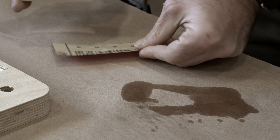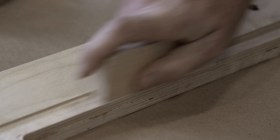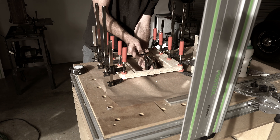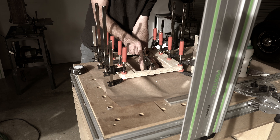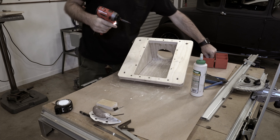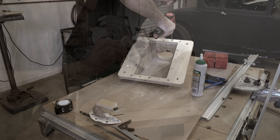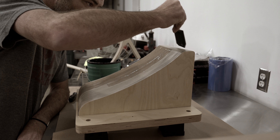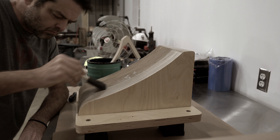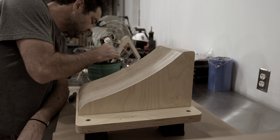To combat the chatter, I used 2P10 to glue some sandpaper to the edge of a three-quarter inch sanding block. This allowed me to get into the pocket and get an acceptable surface. With that out of the way, I just needed to laminate my two pieces of half-inch plywood for the spacer and then attach the chute to the base. I couldn't come up with a good way to clamp this, so I decided to use screws and glue, but I was deliberate with my drill spacing and getting good clean countersinks on the holes. With the piece all together, I could add a finish — four coats of clear satin polycrylic, inside and out, sanding lightly with 320 grit between each coat. I like this finish because it brings out some of the grain of the birch without making it too glossy or yellow.